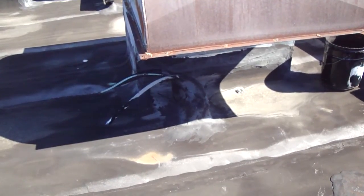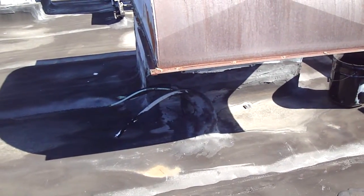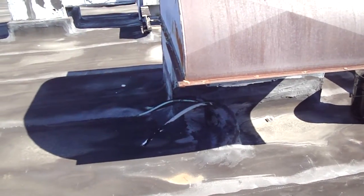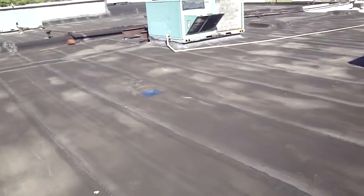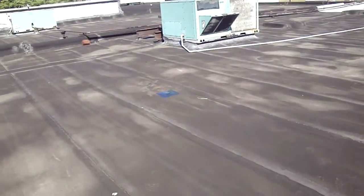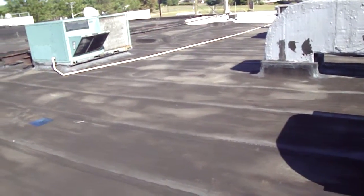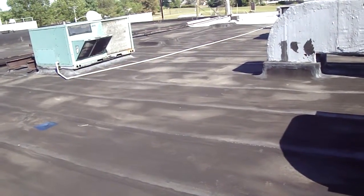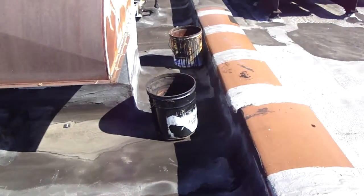This is a roof cement type roof, and that's okay if it's working, and it's okay if your client or your tenant has enough forgiveness to let you slide on a couple of leaks now and then that you can respond quickly to. If you have that kind of forgiveness built into your deal, then you just want to continue to nurse this roof and start budgeting for replacing it within the next 5 years. I think if you're judicious with attending to this quickly and without waste, it'd be worth your while to maintain what you have until you absolutely have to do the roof.